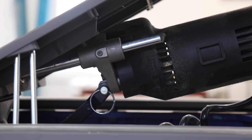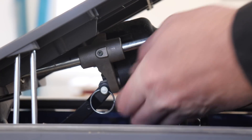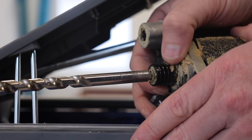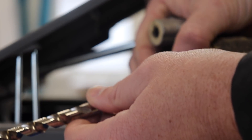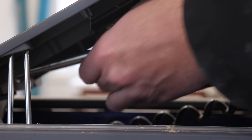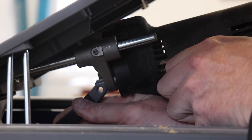Now I'll give you a closer look at what's underneath this plate here. The plate is conveniently supported by a little bracket that easily stores away down inside the machine itself. To change the bit, it's very easy — all you have to do is release this pin connected to the guide arm, then simply slide the head unit out. Changing the bit is as easy as lifting up on this collet and pulling the bit out. It simply goes right back in by releasing and making sure it's set and locked into place. Placing the motor back in is just as easy — slide it down, find your guide rod, grab your pin, align the guide rod with the holes, and reinsert your pin.